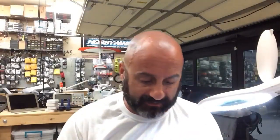That is a 51-minute video because I got kind of carried away into the flipping the switches, the logical switches. But you got to understand, this is an excellent safety feature, okay? Because you can tell the controller now to start doing things, commands. So if you're in your goggles, man, you're in the zone and you're completely missing your LiPo voltage, right? Or you're missing something else, whatever it is that is your ticker, or your RSSI, you're not paying attention that your RSSI is low, right? Then you can tell it, oh, hey, when my RSSI hits this thing or whatever it may be, I want you to tell me to land.